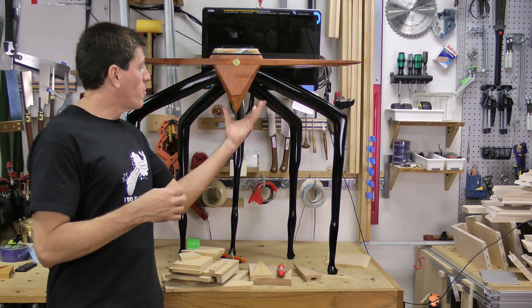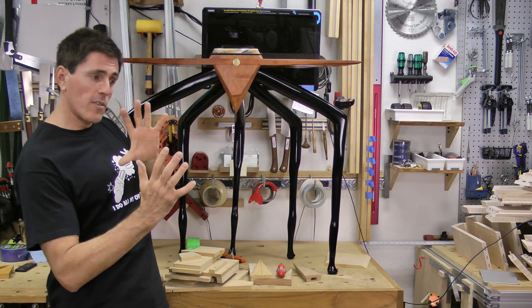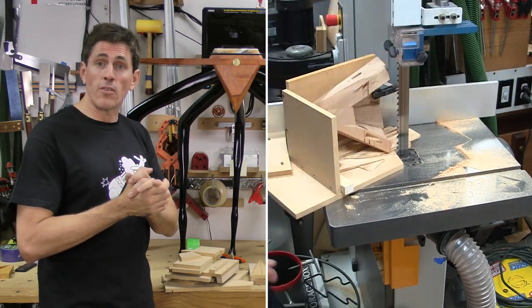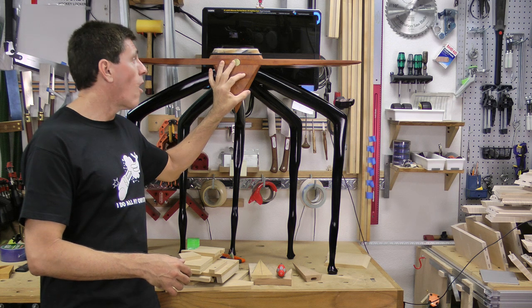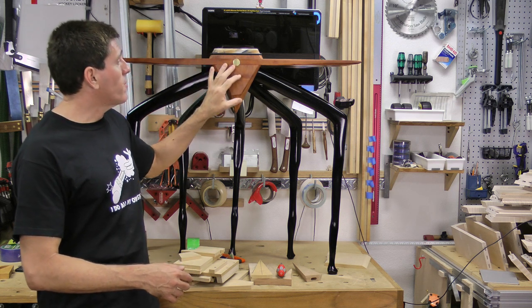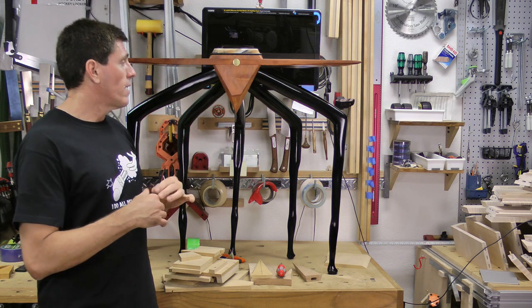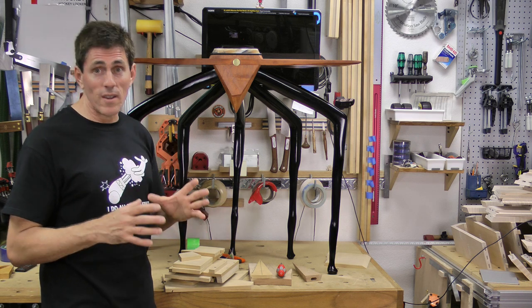So what this is: I completely built this tapered octagon, and then I mounted it onto a jig, and then I cut the tapered octagon whole using the bandsaw in order to lop off different planes, such as lopping off the back to make a flat for it to go up to the wall, and then, of course, the cuts that separate the bottom from the top part of it, and then, of course, leveling off the top, all completely. Now, it seems like a lot of steps for putting it together. It actually goes really fast.